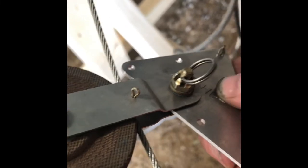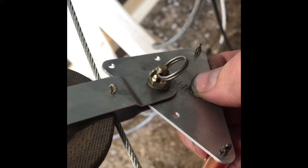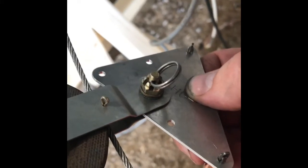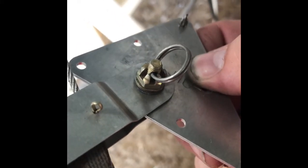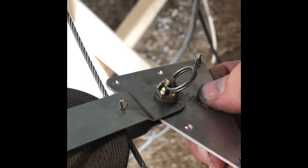Once you're not afraid of it popping out anymore, you can take your pliers and pull the rivet mandrel out of the way and just pull it through the rest of the way. So that's my quick tip for today.